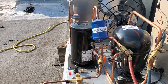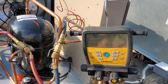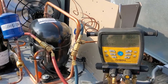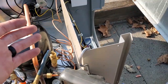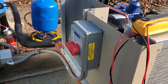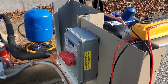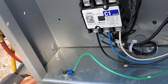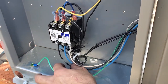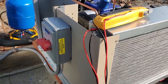What we'll do too is a pump-down test and mark the refrigerant level for the next guy when we're done. I went ahead and turned on the disconnect switch. It is pumping down, so we can go and test the low pressure control right now to see what it shuts off at. Something's not right because it's not shutting off — there's a problem. So we'll have to figure that out. That's why we test things. There's a problem with the low pressure control. The reason why we commission things is to find mistakes and potential installation errors. I had another person up here and they miswired the unit. What they did was they wired the line voltage to the load side, so it never shut off because it had three phase to the compressor at all times. I simply need to switch these three wires to the line voltage side of the contactor.